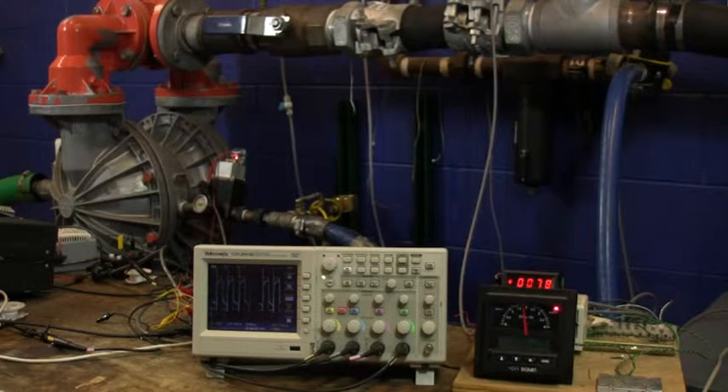It begins watching the pump. It's learning how fast the pump is going, learning about what pressure the pump is running at, and looking at the supply pressure of the air coming into the pump. It's comparing those to the pre-programmed variables inside the software of the Mize Air.